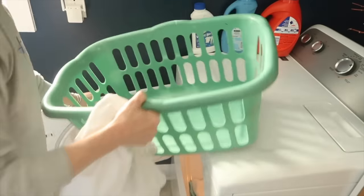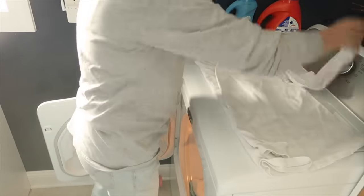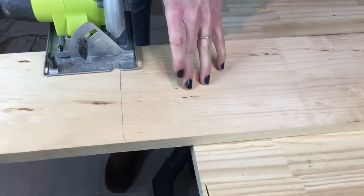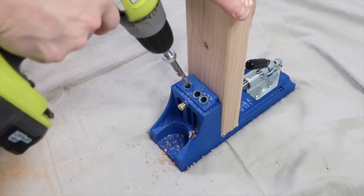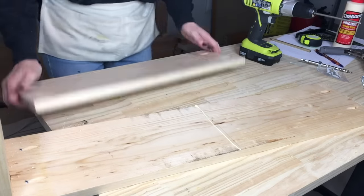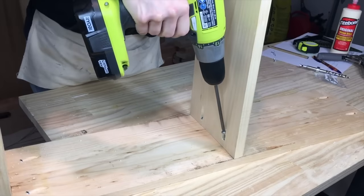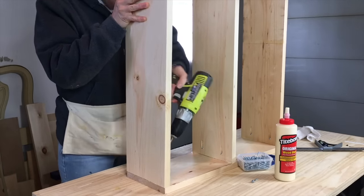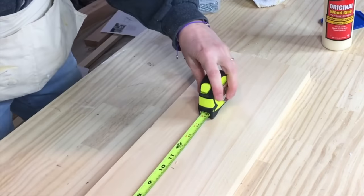I'm not a fan of doing laundry, and when it comes to folding clean clothing there's not enough room in my laundry room. I began by cutting one by 12 inch pine to make the storage cabinet — I made the outside box first. I used a Kreg jig to make pocket holes to join my pieces together, along with wood glue to keep everything in place. I measured for my shelves, marking and cutting them to fit, and screwed them in place.